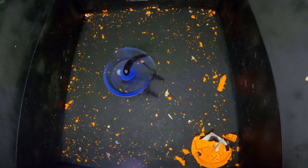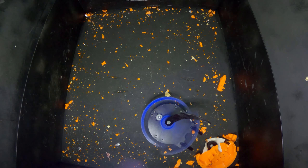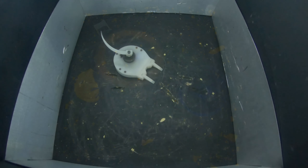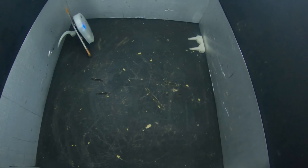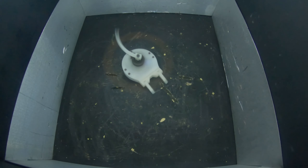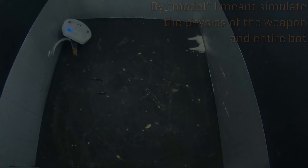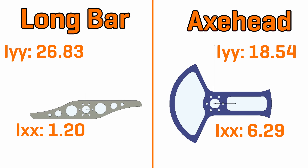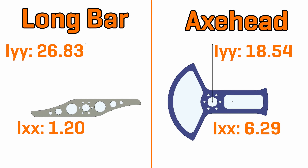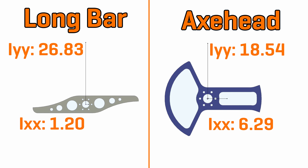Remaining drivable was a real challenge, however, until I got these new weapons. I mentioned in my last update I planned to try something different to minimize the risk of intermediate axis instability, and boy did that work wonders. The old weapon bar has about 23 times the inertia about its long axis as about its short axis. This ratio of 23 to 1 is terrible, and I had no way of knowing how bad it was going to be until trying something different. I'm not aware of any simple calculations to show the upper limits of a stable weapon — if anyone does, please comment below. In any case, I designed this new axe head weapon with a 3 to 1 ratio along the long and short axes.